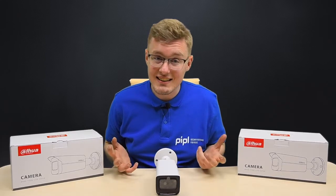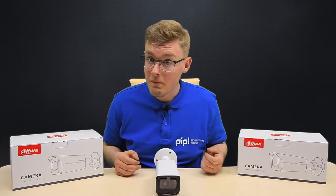so the devices can operate on lines of up to 800 meters in length between the camera and the switch or the recorder itself. So this exceeds the capabilities of the classic PoE standard with a line length limit of up to 100 meters only. And consequently that allows us to eliminate additional network segments. Well, it's pretty awesome and convenient.